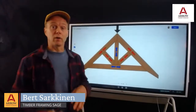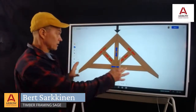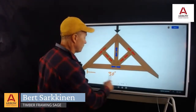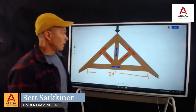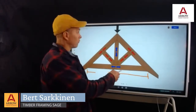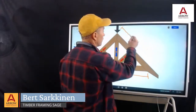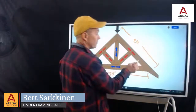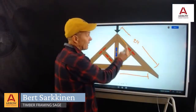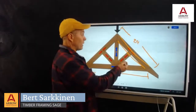We're going to expand on the concept of the truss. We're going to move from the simple truss to a truss of webs. Now, this really looks like a small truss, but let's just say, for example, that we were 30 foot from here to here. Now, these webs, even though this is a 30 foot truss, if this span of, say, 24 feet right here, if this timber will reduce or resist any sagging for the loads applied to it in that 24 feet, then this web doesn't have to be here.